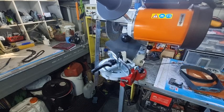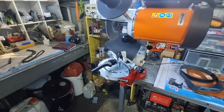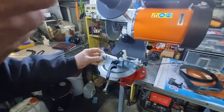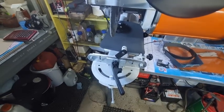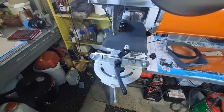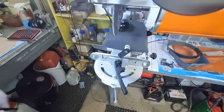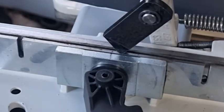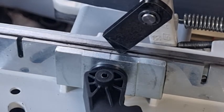Now that's not the only offset the USG grinder has. We've got the offset at the back, the B sliding scale is nothing unusual, but we've also got an offset on the C scale — and we've mentioned this many times before. This is how Stihl works out how the USG grinder changes geometry differently than an Oregon grinder. We'll zoom in and put a chain on to explain things better. It's taken many years to really understand this grinder — it's totally different from Oregon. It looks the same but it works differently.